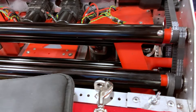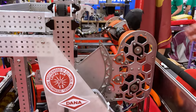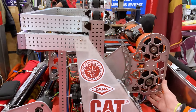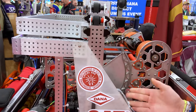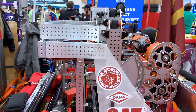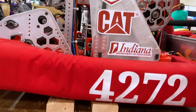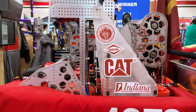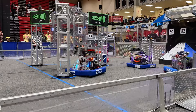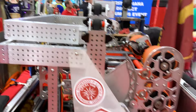From there, it goes into the feeder right over here, and it stages in this little belted section, and it stays there until we're ready to shoot it. That belted section is part of our feeder, part of our shooter, which is also on a rotating gear here, and that is on an elevator which can raise up and down. That allows us to shoot over defense — including smiley defense — drop down into amp, and keep it low and shoot up into speaker. We also recently added a climber to our elevator system, which gives us a very simplistic climbing system that doesn't require an entirely new mechanism. It allows us to harmonize really well and really fast.